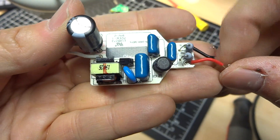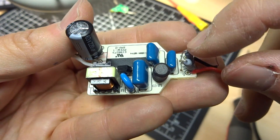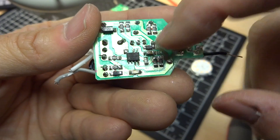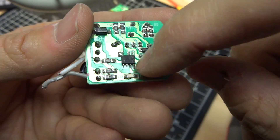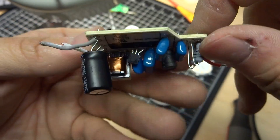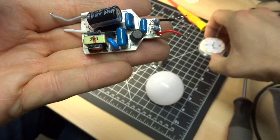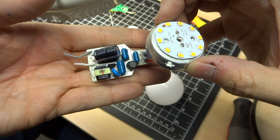Taking a look at the board, it's got a standard topology, although I don't really see any input protection. The controller chip has such bad markings that it's really impossible to tell who makes it — here's a high-res picture, but I wasn't able to find anything on Google from the numbers I could see. This definitely appears to be a non-isolated design, so if you have the cover off, don't touch any of these — this is probably referenced to mains voltage.